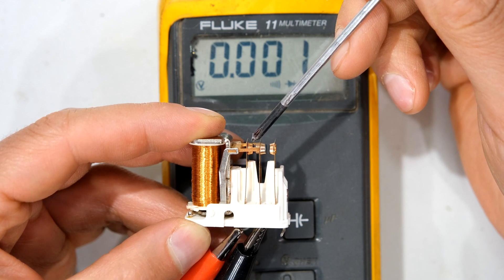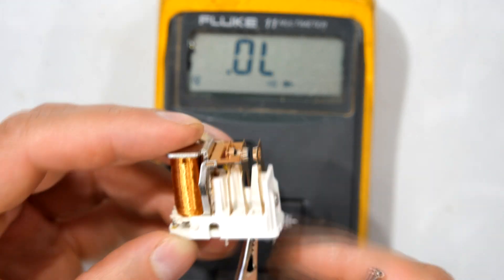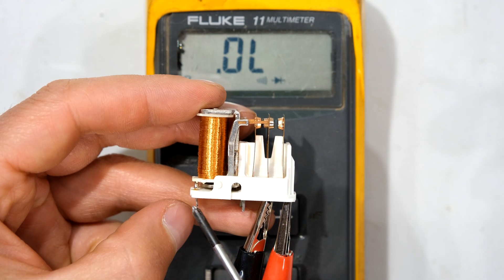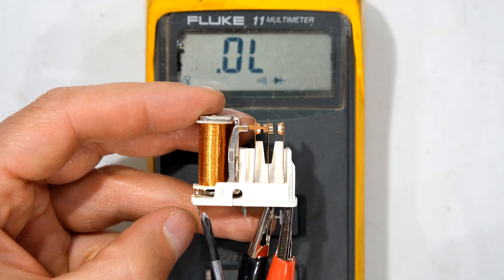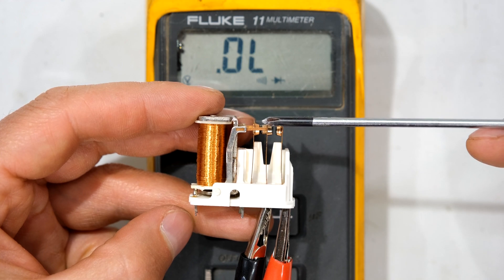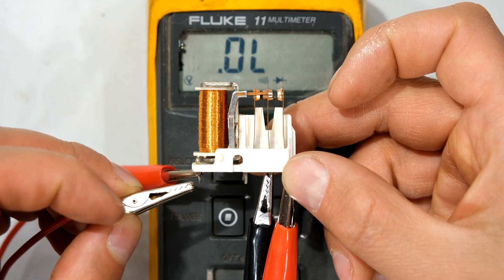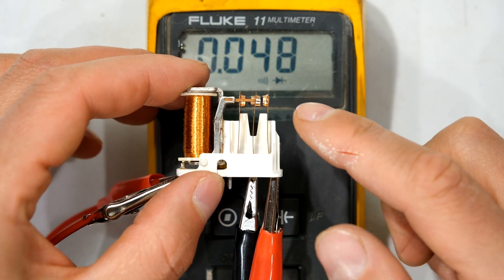You can see that the relay allows me to open and close a circuit. These are the normally closed contacts. If I move to the normally open contacts, the meter says it's an open circuit, and if I move the contactor to the other side it is now a short circuit — open circuit, short circuit. We're using one circuit connected to the windings of this relay to control another circuit. The windings have nothing to do with the contacts. The magnetic effect of the windings moves the contactor, but the current flowing in the windings has nothing to do with the current flowing in the contacts. We call this galvanic isolation — even though I activate the relay with the supply, the current in this part of the relay has nothing to do with the current flowing in the contacts.